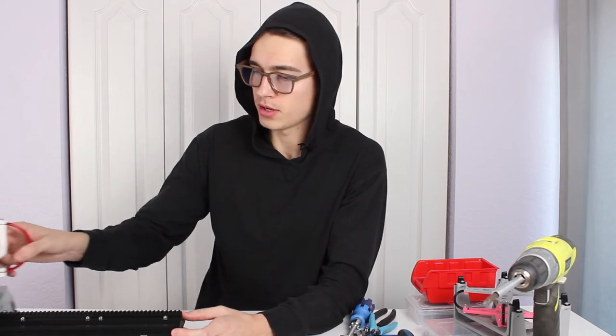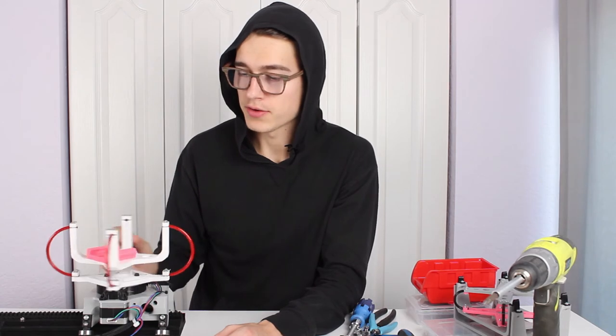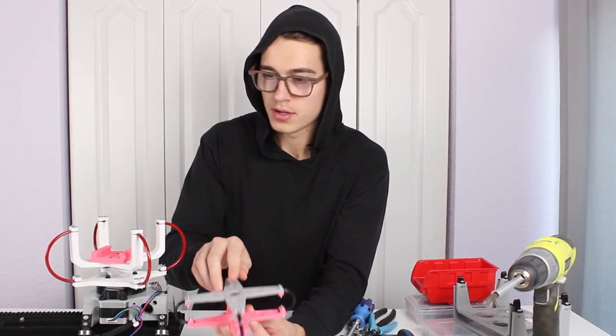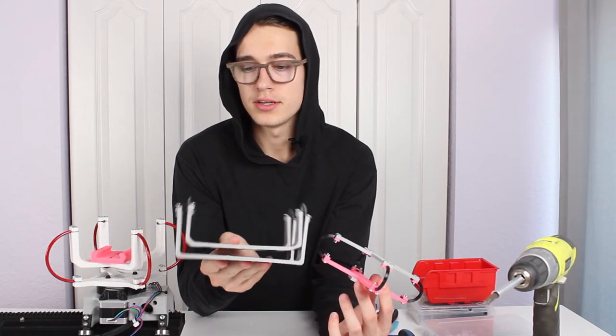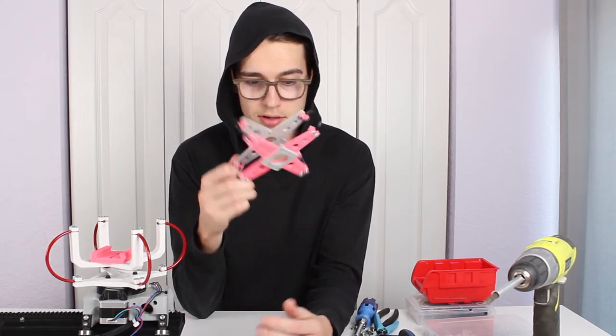Luckily though, a good thing that happened in this whole video is my first try, I actually made a pretty good anti-vibration mount. Or let me just say, as good as one can make at home with a 3D printer. So I made this guy right here. And as you can see, it's kind of a combination of this starting one and this guy. So I used the center of mass idea of this one and the whole suspension flexible part of this one.